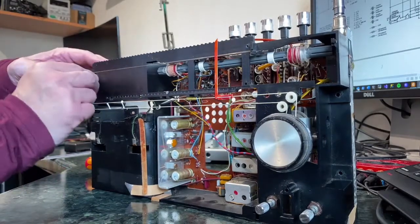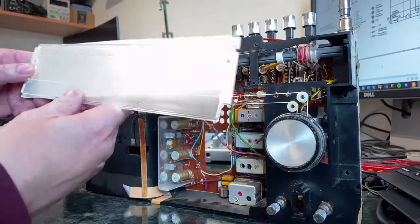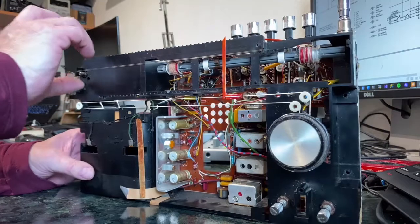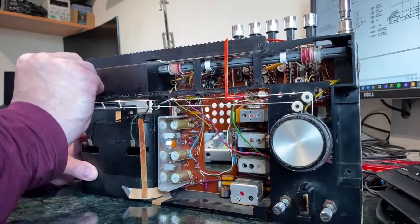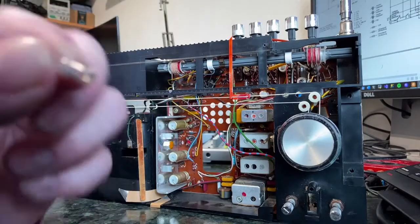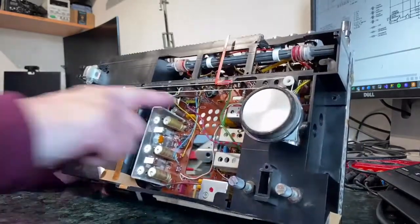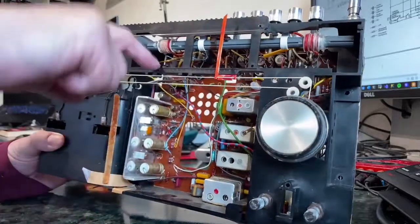There's a little lamp here. I managed to get these 2 things out, which are the backing, which give you a white backing for the tuning things, to show it properly through the window. Now this little lamp here, it's an old style wedge bulb, which you can still get. The problem is getting the things in and out is quite difficult. That has obviously gone black, that's gone. And it's a 7-volt bulb. I couldn't get any 7-volt bulbs. I've got a 6-volt bulb, so what I'll probably do is alter this, I think it's that resistor there, 91 ohm, well, 39 ohm, sorry.